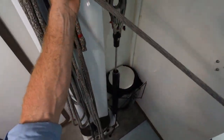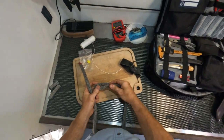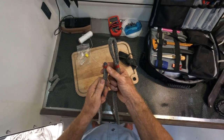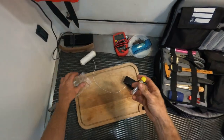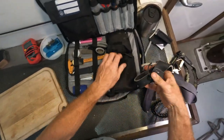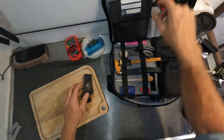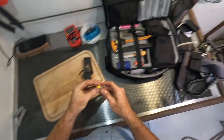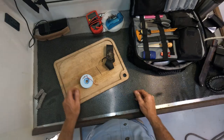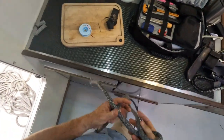The job we're doing today is making some of these little loops. We've got two things going: making a Flemish eye — or Flemish splice — on the end of the rope, this one very short, and then doing a whipping on the other end. So we're going to need needles and twine. I tend to leave white twine in the bag as a go-to — I started my sailing career on tall ships so there's still a part of me that looks at flat white twine and thinks that's how it should be. For these sail ties we're going with red for colour coding, so they don't end up scattered everywhere and we have none left when the mainsail comes down.